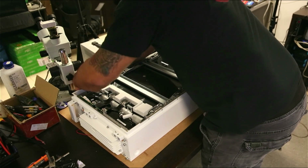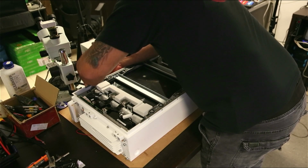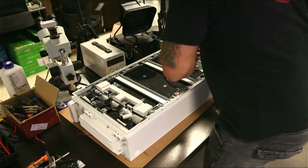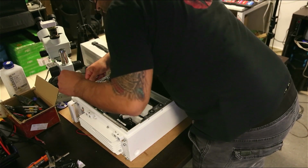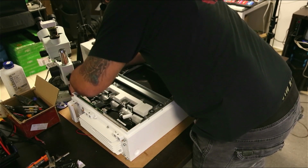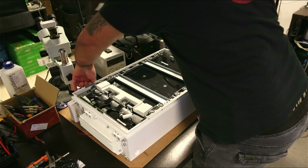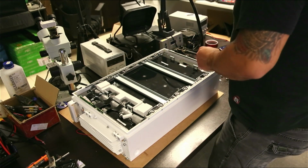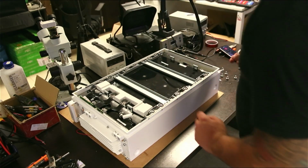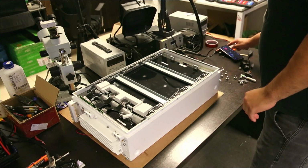I just got this battery yesterday and I'm very curious to see what's inside and if we can actually make something to connect to the Huawei inverter, because that's a popular inverter. Now I can see why those don't break that much, because the DC-DC is handled by this battery, and it also has another DC to DC boost that I think we're going to have a look into as well.